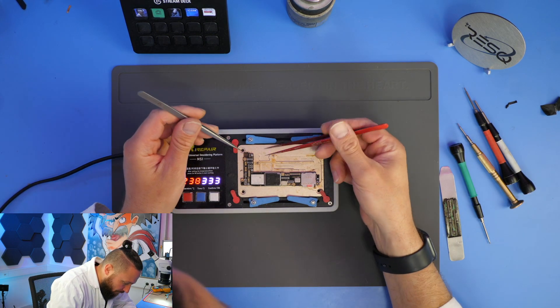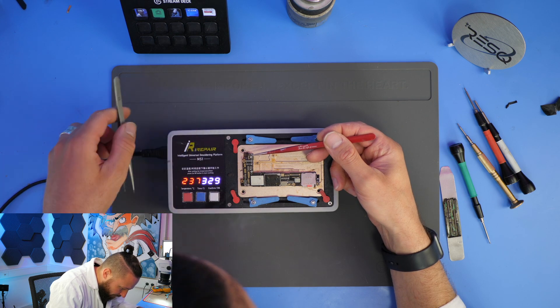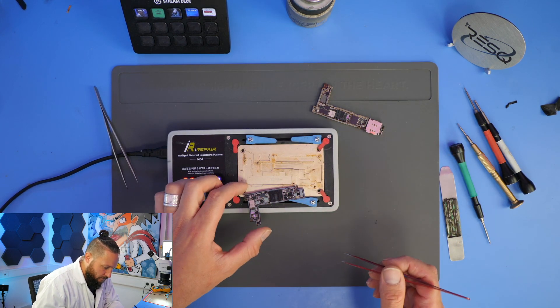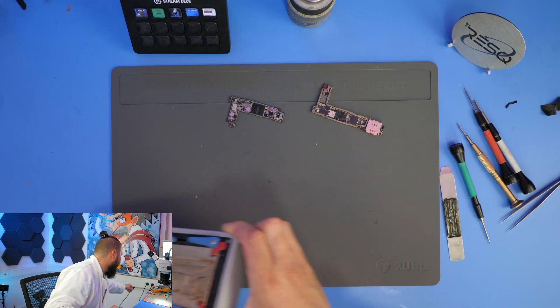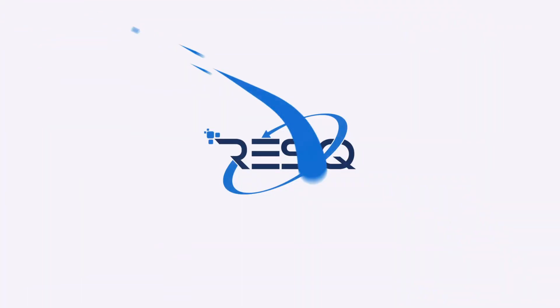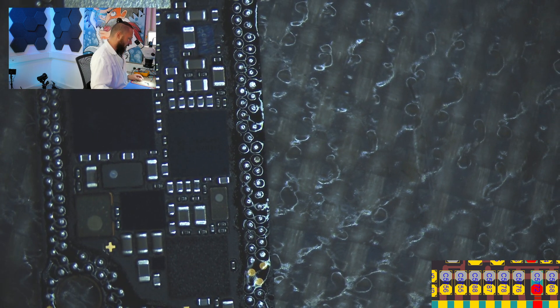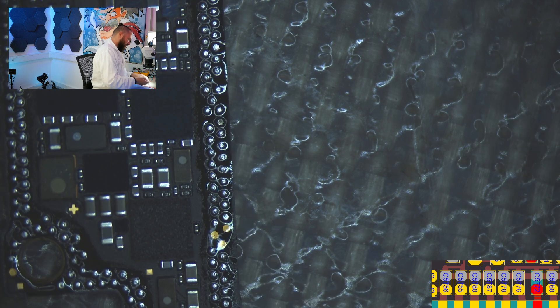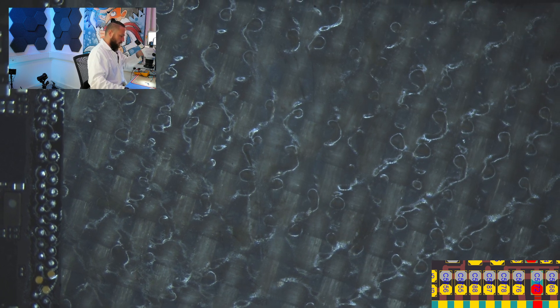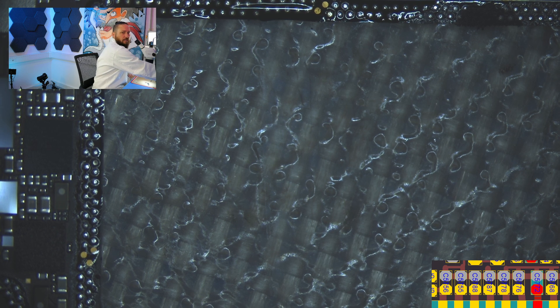Let's see if we can already lift up - yeah, we can. This board was never opened before, you can see it here on the thermal paste. Let's see under the microscope. The pads in this situation really look okay, but we will use some solder wick and then we will really see if we got an issue with gray pads, and then we will solve that. Anyway, we will solve it even if we don't have many gray pads - I want to show you the way how to do that in a good way.